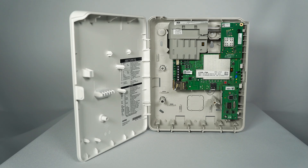For the installation of the IPCOM and LTE-MPX, the communicator is rotated 90 degrees in the housing compared to the LTE-MP series, but the modules install in the same locations. Also, there is no battery or transformer connection for the IPCOM and the LTE-MPX communicator models, as they are fully powered by the auxiliary 12-volt output of the security panel.